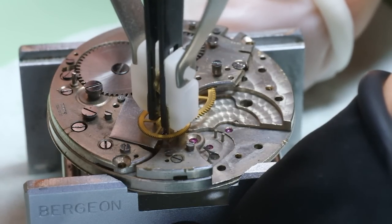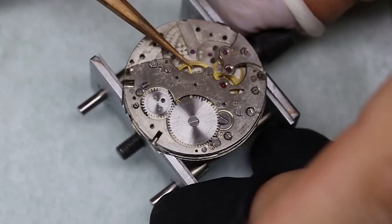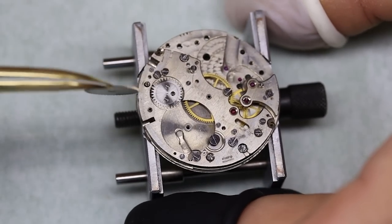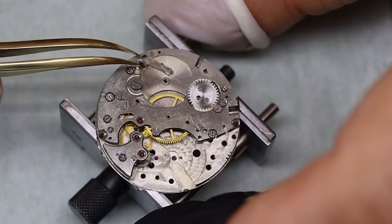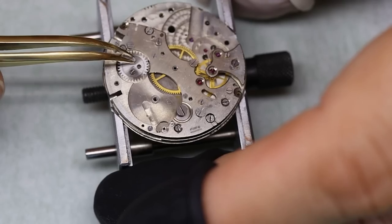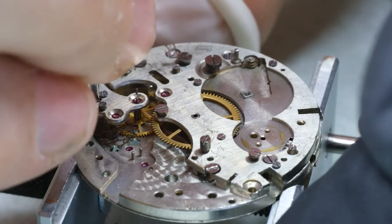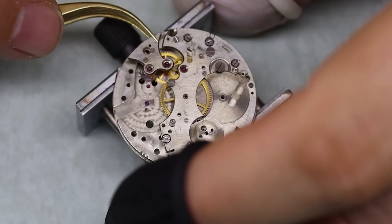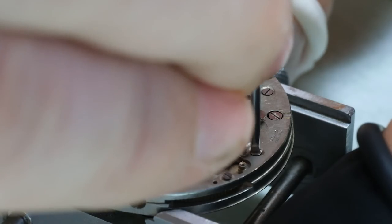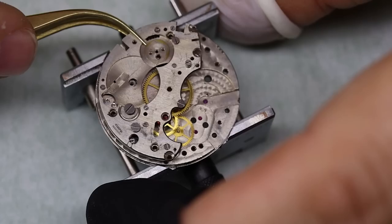I'm going to take off this chronograph driving wheel — I have a special little tool for that. I'm going to use this little extra plate as a bridge to push against. I do see that there is quite some play in the center wheel, but the barrel is fine. Speaking of Breitling, I also did a service on a Navitimer — a beautiful old AOPA Navitimer — with a big brother of this movement inside, the Venus 178, which also has an hour counter. Breitling never had in-house movements until just a few years ago, but it did use pretty much the best movements they could get.